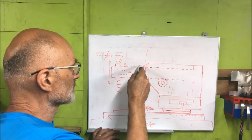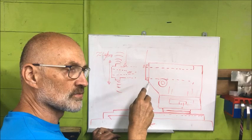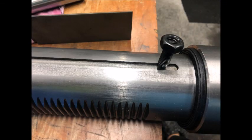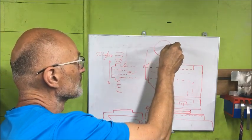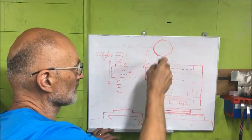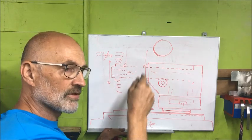You're milling with the spindle in here, locked down, which is not the biggest problem if you lock it down. But how do you lock it down? Is it just with the screw on the side here, which runs in this slot? You have one point — then, if you view the spindle like this, you would press the spindle in towards one side of the bore, which is sloppy. If it moves up and down, what alignment — where does it meet? It would only be precise within alignment — I think it was four or five hundredths here — so you will have that uncertainty anyway.